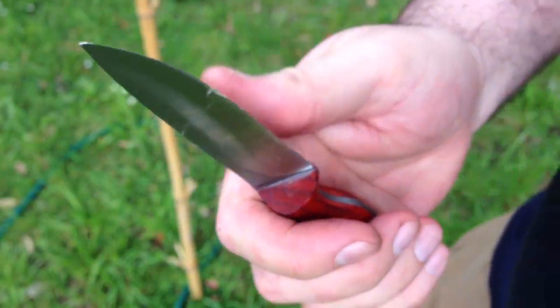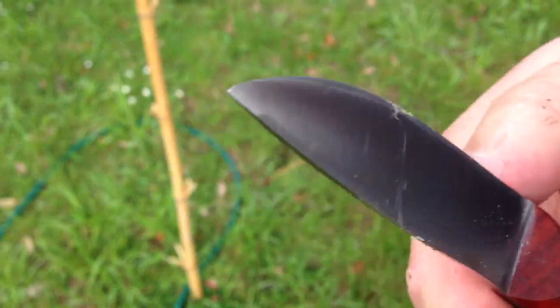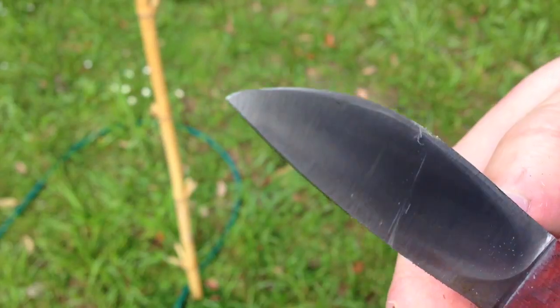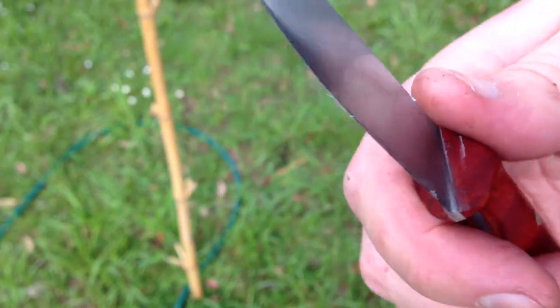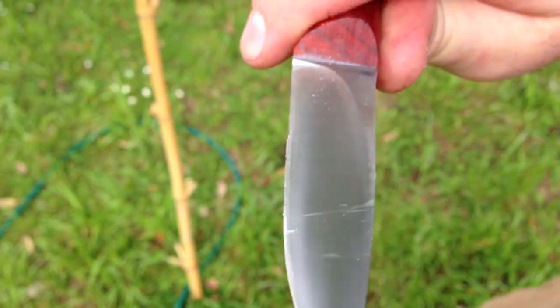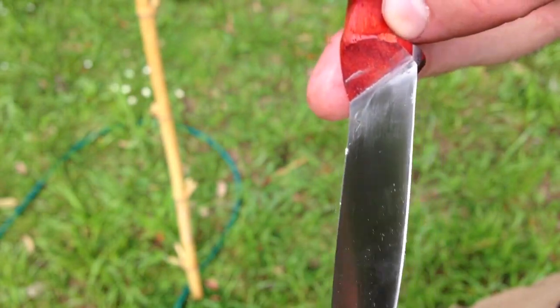And that rolled the edge a little bit. So that's too fine for hard outdoor use — that's my answer. That's why I normally put a micro bevel on, because this is about probably only four degrees on the edge, and it rolled. So I'm going to go cure that on a stone and give it my normal 14-15 degree micro bevel, because that just rolled completely over. But it's tough steel because it did roll — it didn't chip.